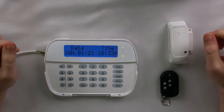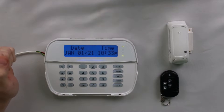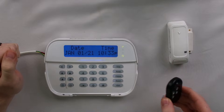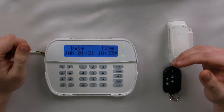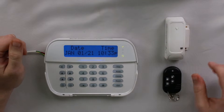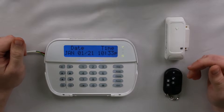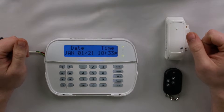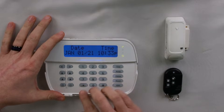For the not networked trouble, the only way I can actually force it to show up on the system is to enroll these devices by just typing in the serial number. So that's what I'm going to do. Then I'll show you what the trouble looks like for door contacts as well as key fobs, just because they show up differently, and then I'll walk you through the process of how I get them to make that initial connection. I'm going to enroll these real quick.